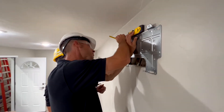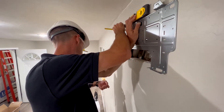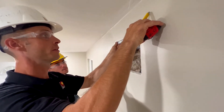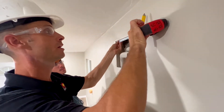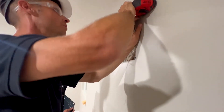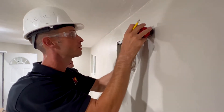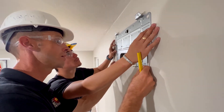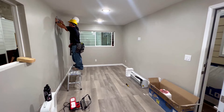We want to get the two-and-a-half-inch deck screws. Let's mark the middle of this — we want to make sure the air handler falls right in the middle of the seal he's created. He's at 14 and a quarter, so we'll go to 7 and an eighth and that should bring him right to the middle. We'll bring this down so that it covers the entirety of the seal.